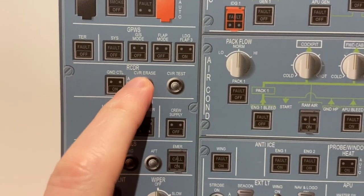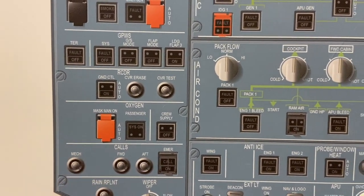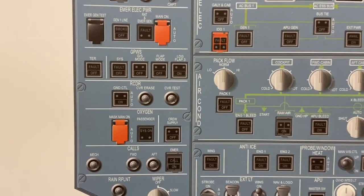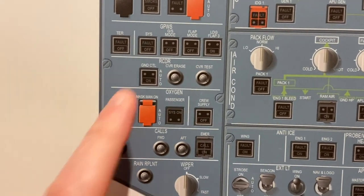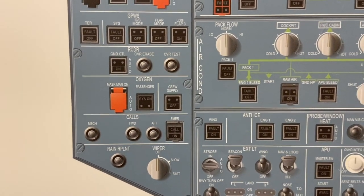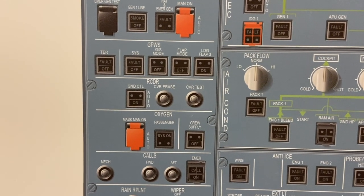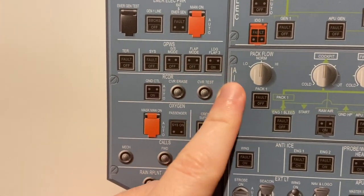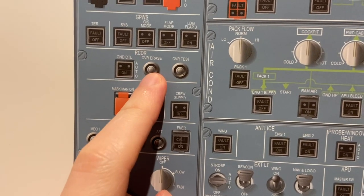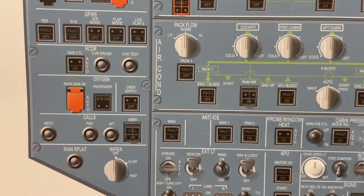This is the cockpit voice recorder or CVR — this is the panel where we can control that. This is to manually switch it on and start recording, as it only starts recording through the microphones in the cockpit during the first five minutes after aircraft power up. After five minutes it stops recording, so we manually select that on when we get in the cockpit so everything is recorded during our checklist. If that is not switched on, it automatically starts recording after one engine has started. Fun fact — it only saves the last two hours of recording. There's also an erase button we don't press, and a test button we use first thing during cockpit preparation.